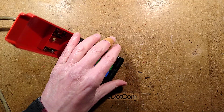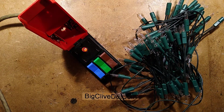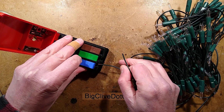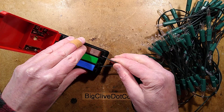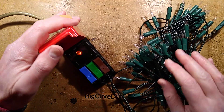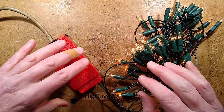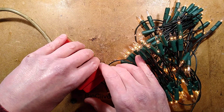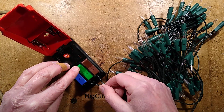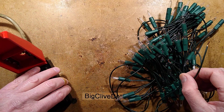Let me plug something into this — here is a set of lovely fairy lights. The idea of this device is that if you work in a maintenance department of a factory or perhaps in a test workshop, you can connect mains equipment that doesn't come with a plug as standard, and when you lower the lid down it safely connects your device without major risk of electric shock. It's not really designed for home users, because people who get used to plugging into these can stick the wires in the wrong place and end up sticking earth into the live, and that's not good.